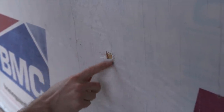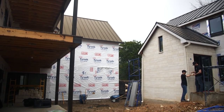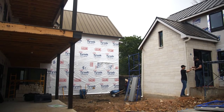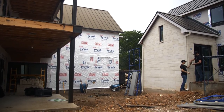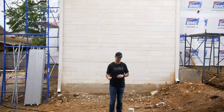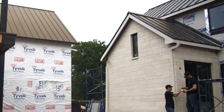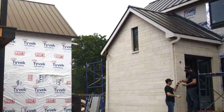This was a perfect area for me, since the stone was already coming down, to run this test. We're going to run a hose on the outside of this wall. This is a gable wall — we've got maybe a one-foot overhang here, but this is a very high-exposure wall. The base of the wall is going to get wet in a rainstorm, let alone that 2 a.m. rainstorm with sprinklers hitting the house. We've also got a window up there with a windowsill, and it's really hard to keep water from penetrating behind that masonry facade when you've got a punched opening like this window.